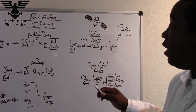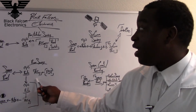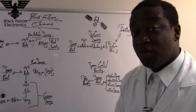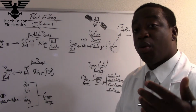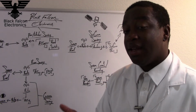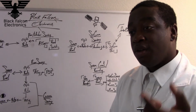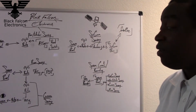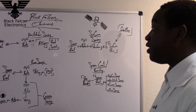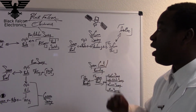Now, how is that beneficial for Project Castle Guardian? Well, it's beneficial in that you have your Arduino. Notice it's an Arduino, not an ATtiny that I've normally used. The reason why I use the Arduino is because in this situation it does support libraries and different functionality, which is something that I want and need, because ATtinys are just reading a state, on, off, good, bad, and information coming from the radio. The Arduino is capable of a lot more, and a series of libraries are needed for the systems that I have installed for the Satcom Sentry.